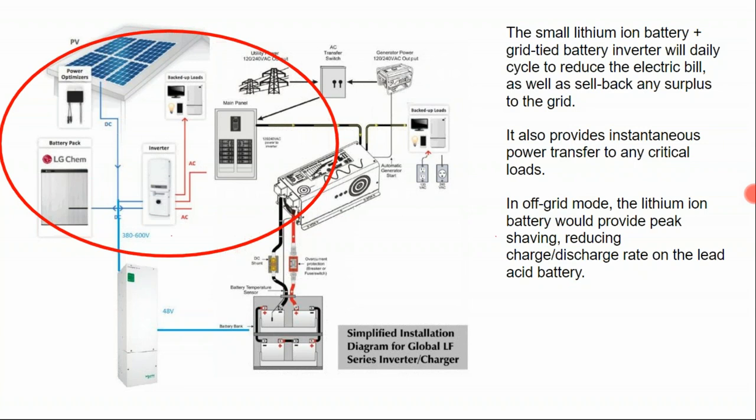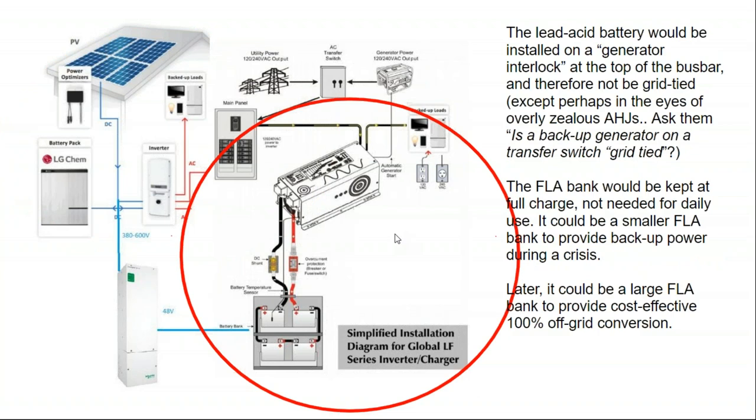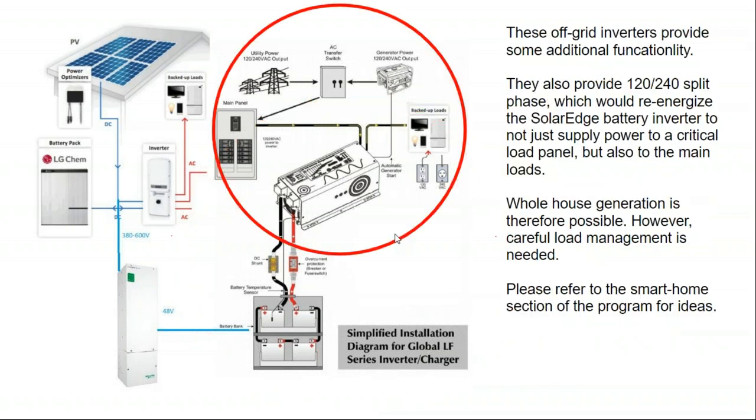I guess one thing we don't have a slide in here for is people are discovering that battery inverters such as the Tesla Powerwall are not capable of powering an entire house all at the same time. And so there's a number of companies trying to do what I just showed you with home energy controls to make sure the devices turn on at separate times so that the whole house can be backed up off of a smaller inverter without tripping any breakers.